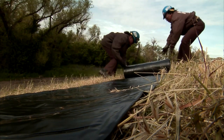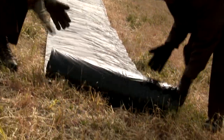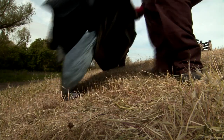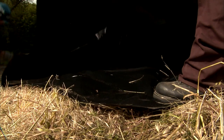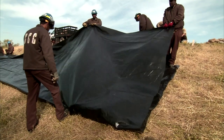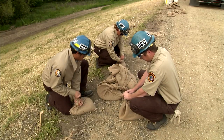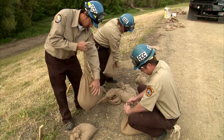Below the stakes, the plastic sheeting is rolled out just above the area being protected. Several flood fighters hold the two edges of the plastic and shake it out to create a 10-foot-deep envelope. Position the envelope's open edges so they face the top of the levee. The flood fight crew stands on one edge of the plastic and opens the envelope. Knotted sandbags are thrown inside to the bottom of the plastic, about one foot apart. The knotted bags are one-third full and can be easily tied by holding one of the corners and spinning the bag.